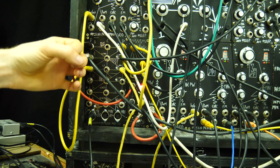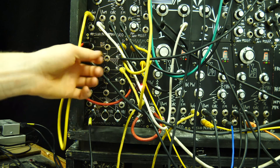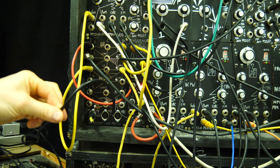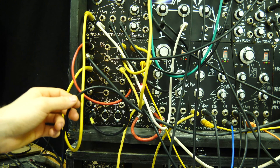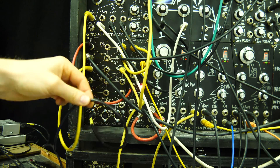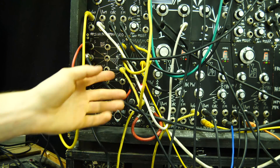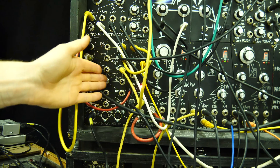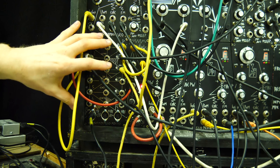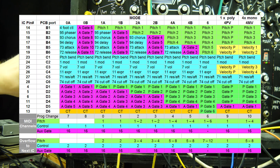You can use a clock divider to bring it down to a preferred resolution. To change modes, you download small files from the MIDI Muso site and load them into your DAW like Logic, then press play with the MIDI to CV module plugged into the MIDI interface. Even a USB keyboard with a MIDI output can act as a MIDI interface to program the controls. The most useful mode is probably the default four-voice mono one. Alternatively, with a sequencer like a Circlon or MPC, send program change 99 followed by the designated program change for the mode from the MIDI Muso table.